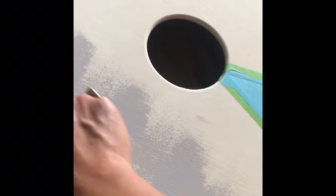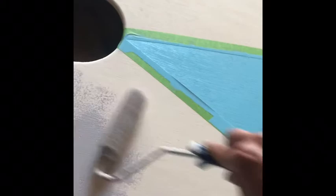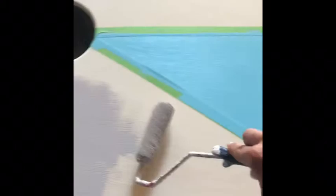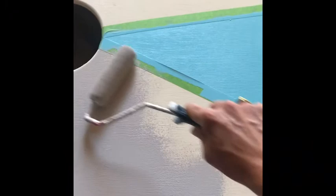So I've got my paint and my paint tray — I like to kind of dab two or three times and then roll it to even it out. I'm going to take my time rolling it on — I don't want to go too thick because I want to get a nice even coat without any big splotches or bubbles. With this nap I'll probably have to do a second coat just because I might get some of those splotches. I'll be careful even with the painter's tape — I know it's safe, but I don't want to go too thick and risk that.